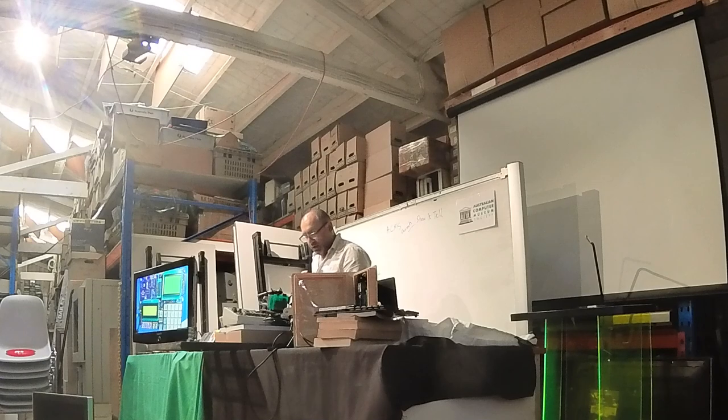All right, so let's start. I'll just type in some code briefly. I just want to output something to the segment out here, just light up the segment. So I'll do 3E, which is load A, 01, which is port 1 for lighting up this particular digit, D301, so that port.